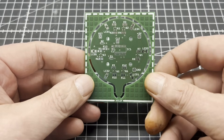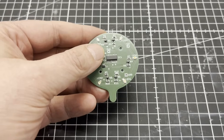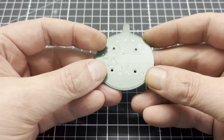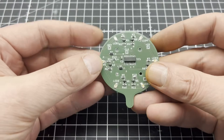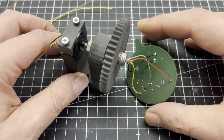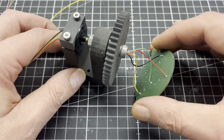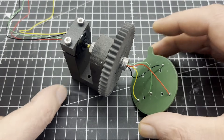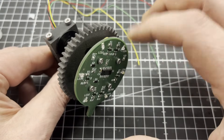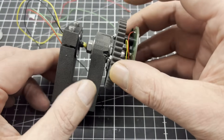Next up was the LED ring. The ring currently features 6 LEDs with a wavelength range of 390 to 628 nm, but many more LEDs could be added. The LEDs are controlled via a 4017 decade counter, so only 4 wires are needed: plus 5 volts, GND, clock, and reset. The LEDs are not driven directly by the 4017 but by n-channel MOSFETs, which ensures constant brightness. In the next iteration I would like to make the LED rings easily replaceable using a plug-in system, so you can use different LED rings for specific tasks.